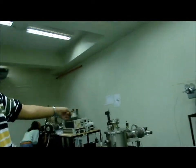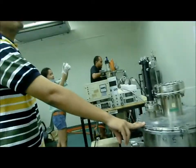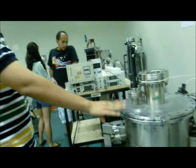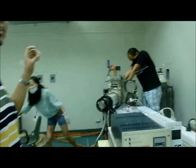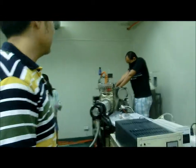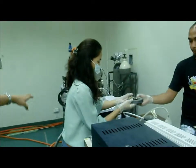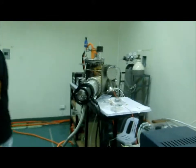If you work with magnetic materials, magnetic metal, which chamber do you use? I'll use this sputtering chamber. In our lab we have two magnetron sputtering chambers. This one is for ferromagnetic and oxide materials. We deposit precursors for superconductors here, or zinc oxide, or carbon. And in this RF magnetron sputtering system, we deposit titanium, aluminum, and for reactive processes, aluminum nitride.